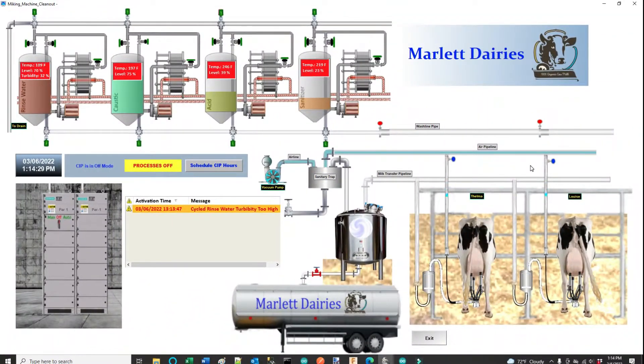This is the graphical interface for this application. Here you can see a dairy milking parlor, and I'm setting the times and monitoring the clean-in-place processes of the pipes and the milking equipment. I decided to use a SCADA program for better control and monitoring. I think for this project it's actually less expensive than using a full-blown cloud application, since Amazon charges per use of functionality and time. I'm only using AWS's subscribe and publish — MQTT — functionality. The name of this fictitious dairy is Marlette, actually the name of a text font I found.